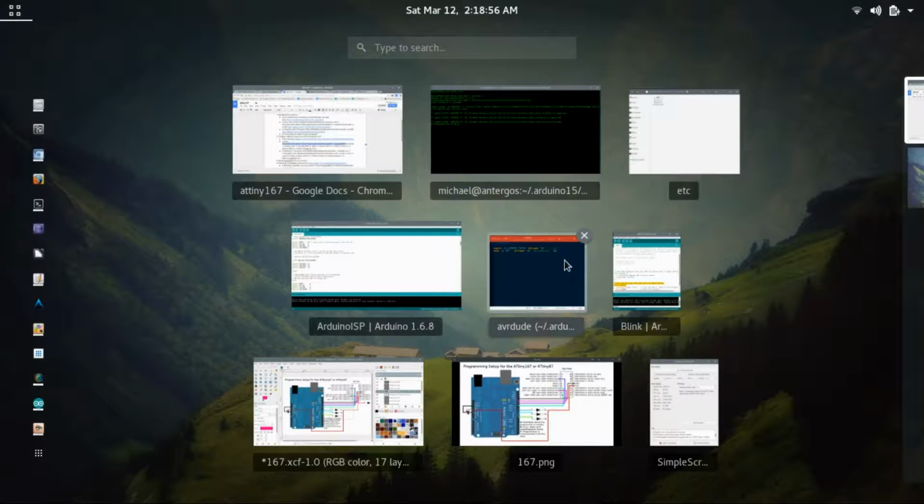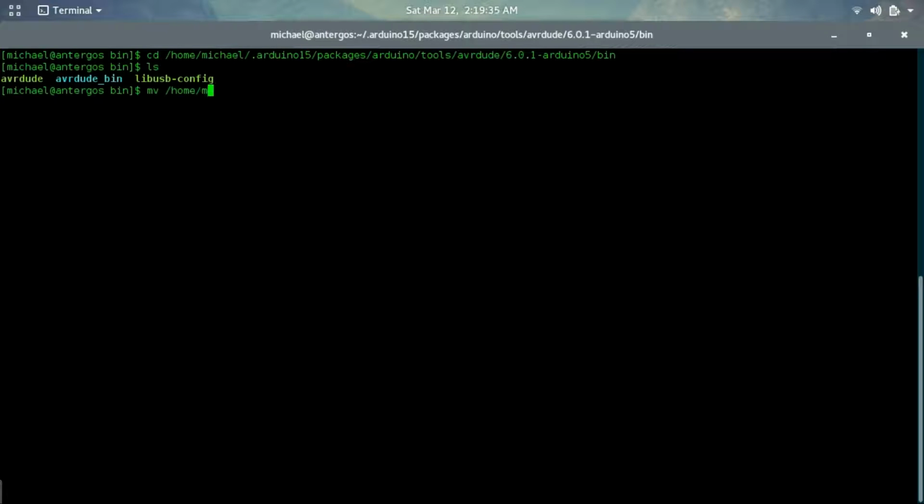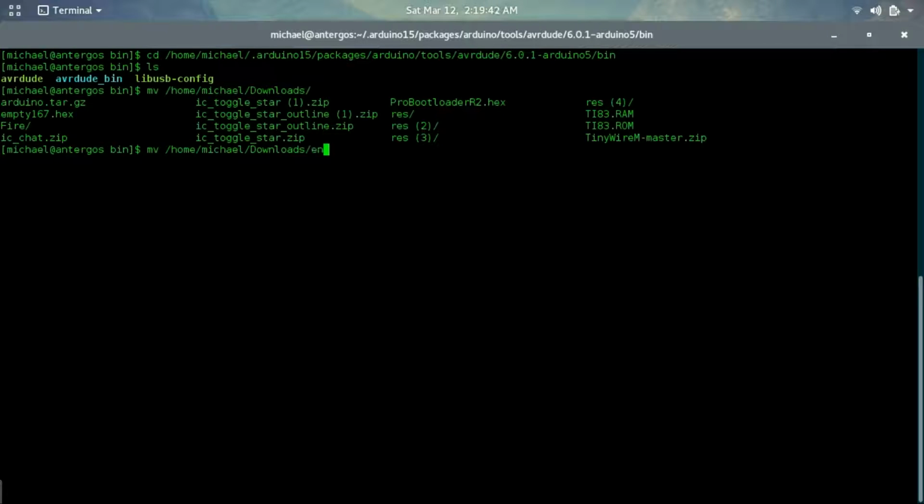So from your terminal, you can go ahead and type in cd and the location, and I'll have this in the description as well. First copy over the hex file into this folder. Let me check if I have the file already in here, which I don't. So what you want to do is use the mv command or cp command and go into /home, your username, downloads, and then empty167.hex, and then space, and then dot, and that should move it to the current folder.